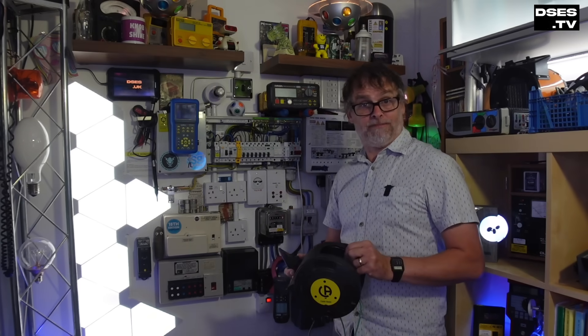You let me know what you think. Anyway, this was a quick and dirty vid to demo two ways of tripping a no-load RCD, which you may once in a blue moon experience on site for some head scratching. If you come across such a fault in the wild, look for an earth-to-neutral short and pay close attention to bonded services such as gas cookers, water heaters, combi boilers, gas fireplaces and the like. Linda and I performed a basic resistance test to ensure our pipework was bonded somewhere to our supplier's earth, so we knew we were looking at leakage back-feeding into the RCD on this one. Let's go back out to the action on site.